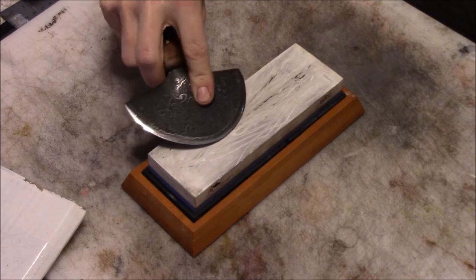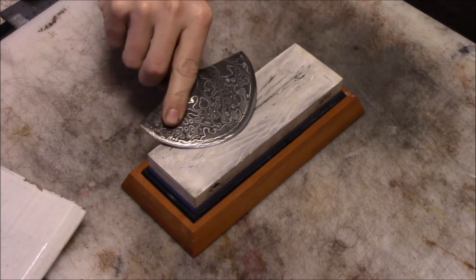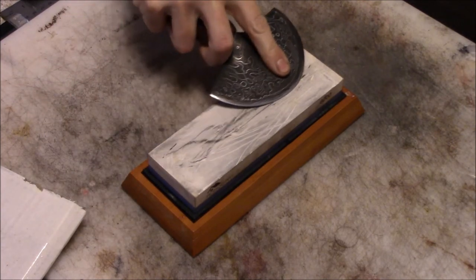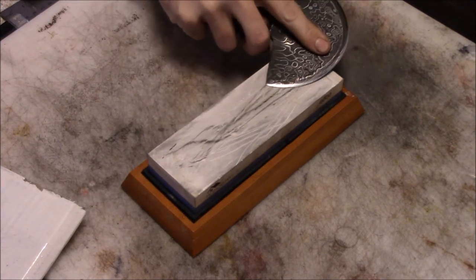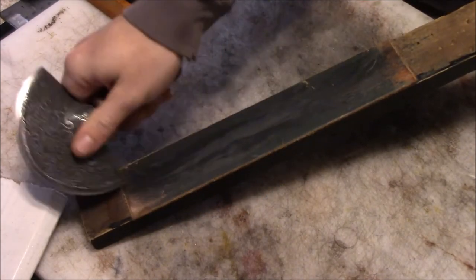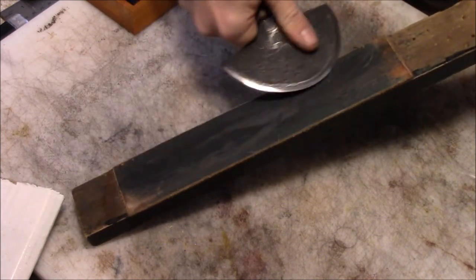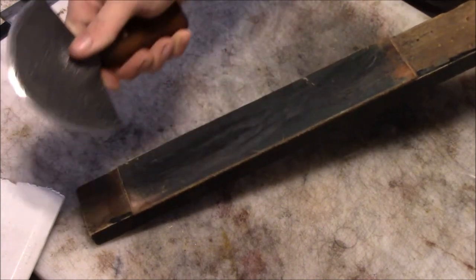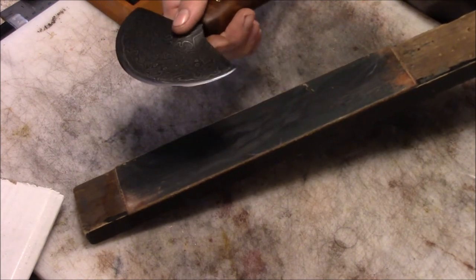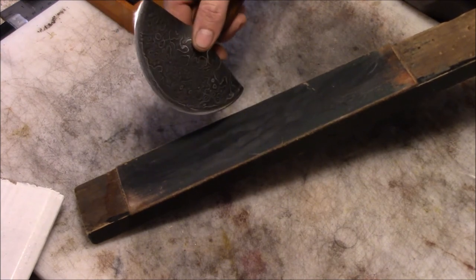After that's had a chance to set, we're going to go ahead and sharpen. This is the last step of sharpening — it's been through several different iterations of stones up to this point. This is a 6000 grit stone and then a strop to finish it off. You want to polish that edge until it is like a mirror — as shiny as possible — because then it's going to glide smoothly through the leather.